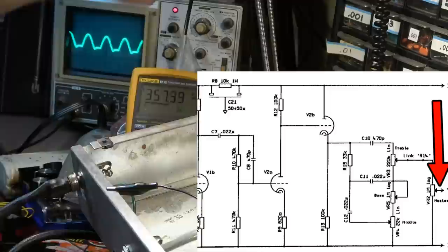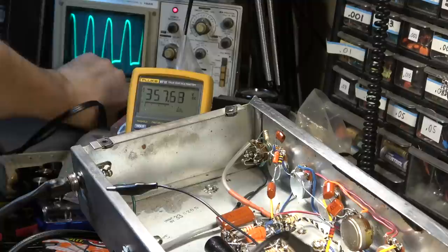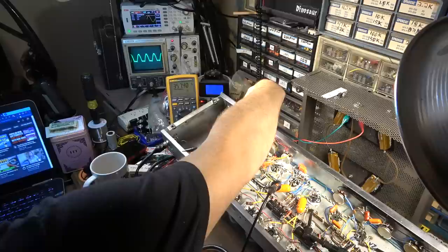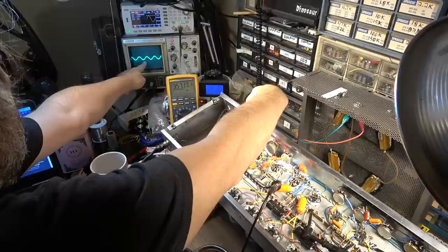Man, I don't know about that. See, if you push this thing into clipping that early, crank it, getting a lot of clipping on just the bottom edge of the wave only. It's really asymmetrical. Okay, see, this is turning the first gain control, and right there it just flattens out on the bottom of the wave completely. Right there, boom, it just becomes flat, just chopped right off.